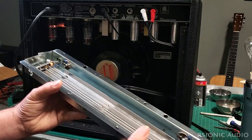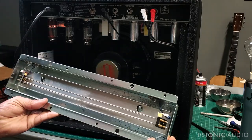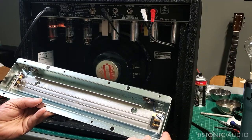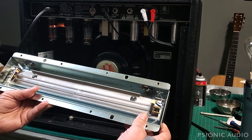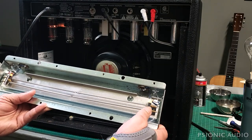I've confirmed that the grounds are connected and the whole thing is properly set up — which one's isolated from chassis, which one's connected to chassis. It's not something simple that's wrong with this. It is a terrible sounding reverb tank, and that happens a lot with Accutronix and Beltons made in the last 15 years or so.